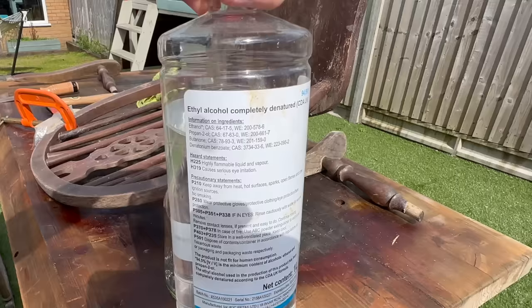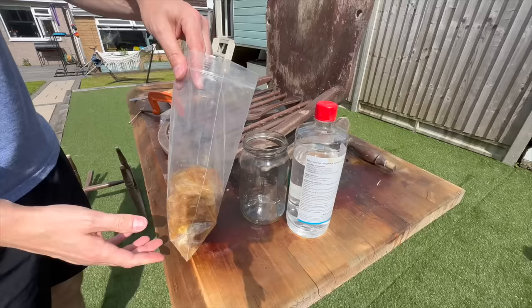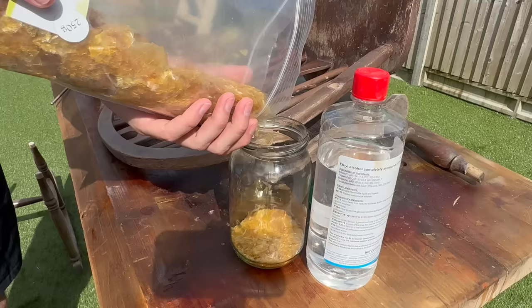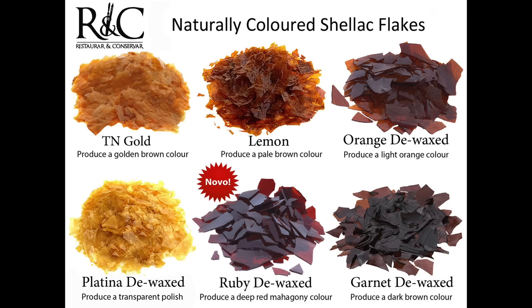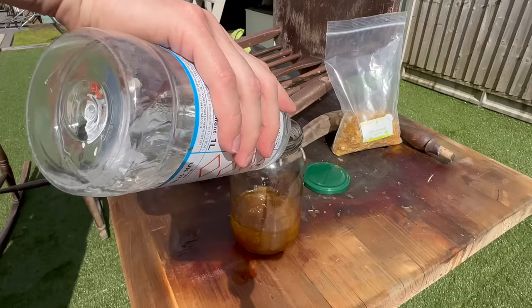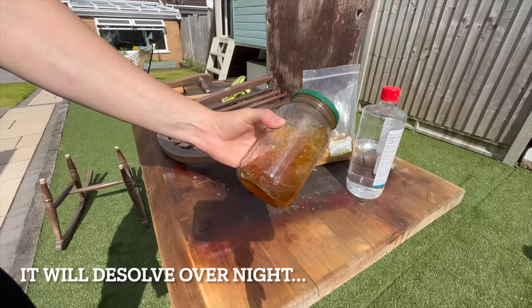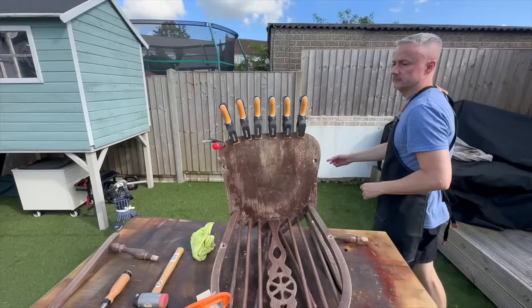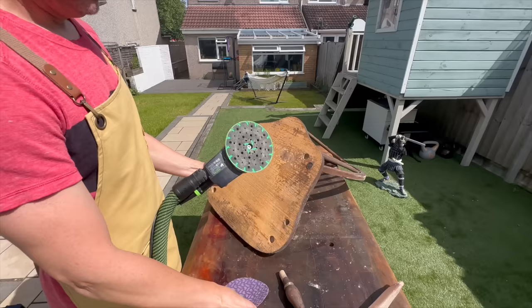While waiting for the glue to dry I decided to make some shellac because that's what I wanted to use as the finish, and I had some flakes sitting around for a long time. This was actually blonde color, which is almost the lightest. Shellac is made from the secretion of an insect and it comes in several different colors based on the wood sap they feed on. It's been used for many years and it's very simple to remove - you can use alcohol or acetone. Alcohol is also what you use to dissolve the flakes; it takes about 24 hours, maybe a bit more, and you can also grind the flakes to make it quicker.